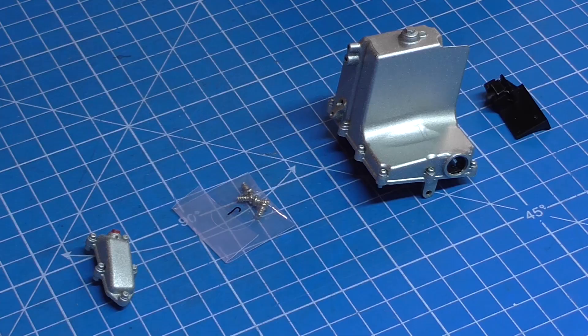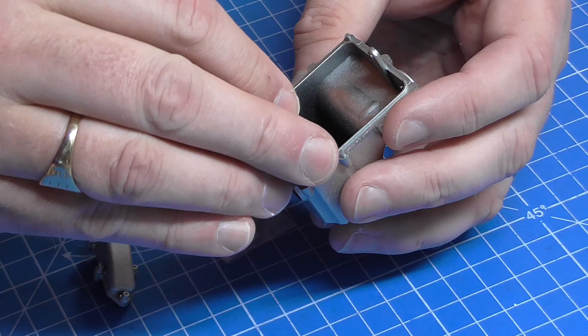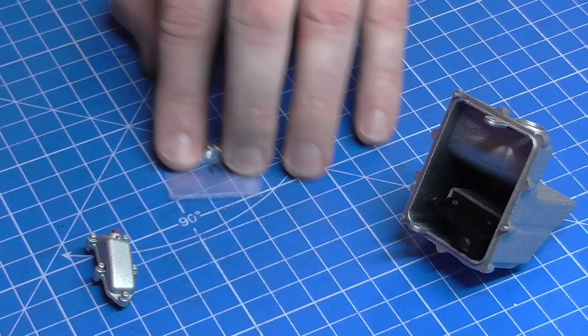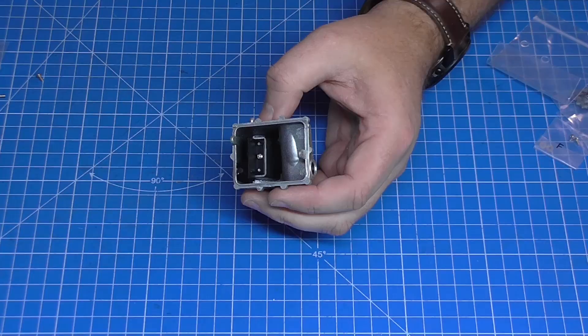So you can see that I need everything that I've got in this little line-up here. The first thing I'm going to do is take the part that we made last time with the switch - we're going to be putting that inside the sump just there. There are two locating holes in there, so when I put this in and get it over the locating holes, as you can see the switch is over the top, just like that. We're going to hold that in with a J-screw, just going in there. And as you can see, we've got that familiar click from the switch there.